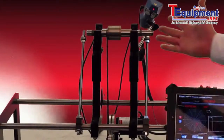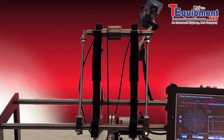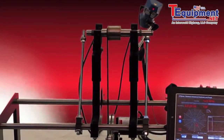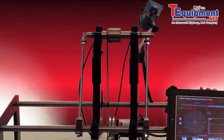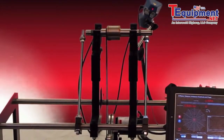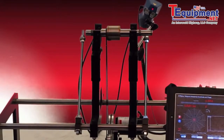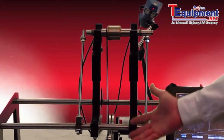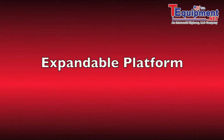Quickly on the machine, it's a two-plane soft bearing balancing system controlled by a DC motor, so we can run very, very slow speeds and accurate speeds. It's got run and brake, and reverse if we want to run in a different direction. It also enables all the stanchions to move for height, different widths, and different bearing size levels, etc. And of course your belt tensioning device is pretty typical of balancing machines.